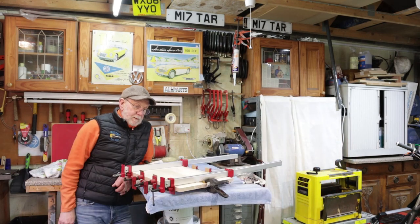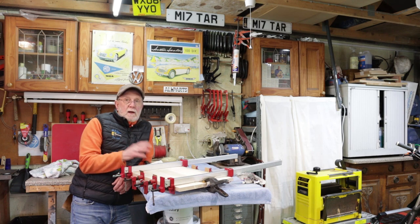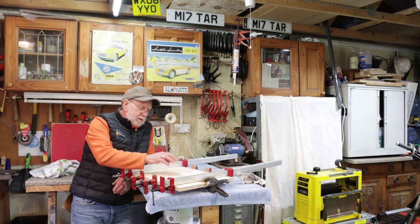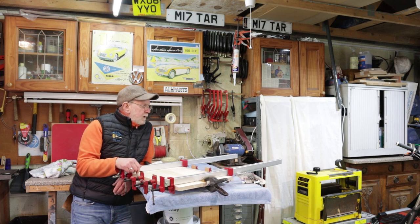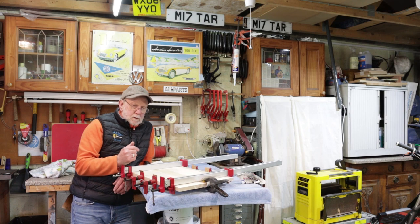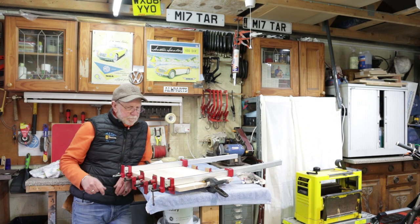Right, next thing now, I'll take these clamps out in the morning and put it through my thickness sander again to flatten the top and the bottom off. I won't video that. Then I'm going to machine the mahogany back. This is going to have a carved top, and I'm going to try, in the depth, to do a fake binding all the way around it. It's not something I've done very often. It's time consuming, and I'm going to have to be pretty sharp with a chisel.